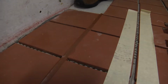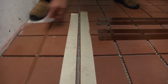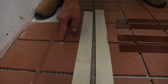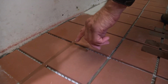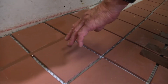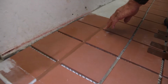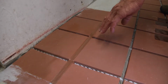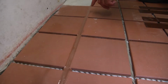And then the next day, we're going to take the tape. This brown tape will be, imagine, coming out to here. And we're going to run the caulk in the next direction after it's cured 24 hours later. The Marcoat ES is designed for extreme service, that being mostly cook lines and dishwashing areas, wet areas. So it's a very high-end product, and you may not want to install it throughout the entire kitchen, but certainly in a cook line and certainly in a dishwashing area.